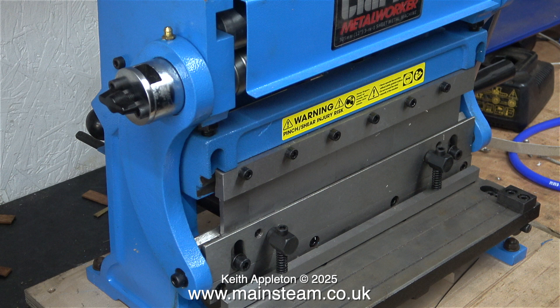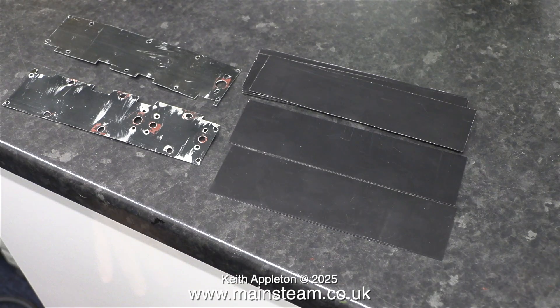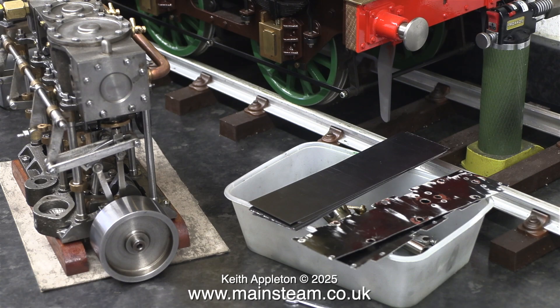I like this small inexpensive machine very much. It's only suitable for cutting and bending thin sheet metal — it's not a big industrial thing. Here is the content of more or less two baking trays: that's eight pieces of cladding suitable for a triple expansion engine. Normally I would use a thin piece of card — the thickness of a birthday card is ideal — cut to shape, fit it in place on the engine, then push the holes through using a scriber. But with so many pieces, if I make a mess of one I have more to go at, which alleviates the nervousness I'd normally experience with only two pieces of metal.